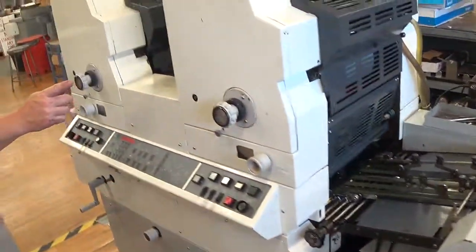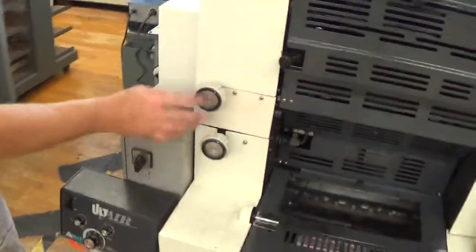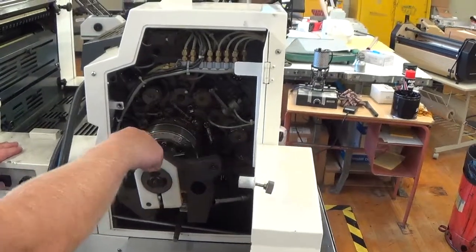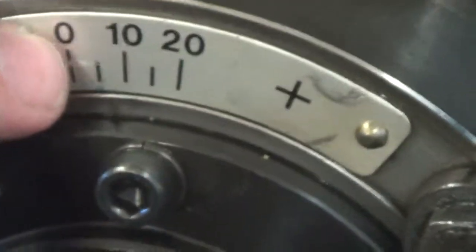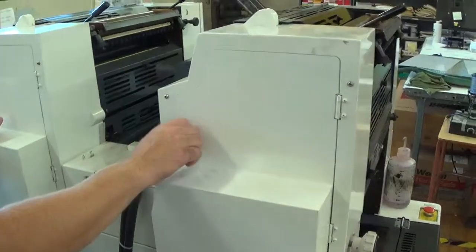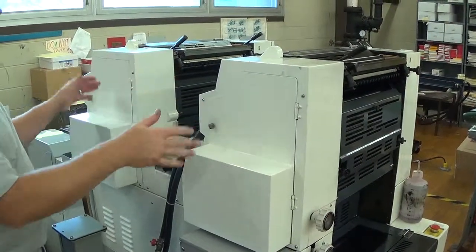One thing I need to mention: remember we talked about these adjustments? These are micro adjustments left to right and front to back. But when we first start out and are really off, we want to use the macro adjustments in here — loosen up three bolts, then use the Allen key. There's a very faint little groove that's my marker, following a gauge from negative 20 to positive 20. You have the same thing on the other side. When lining up two colors, it's not always the same adjustment — it'll be close but not identical. Also, definitely bolt these up because vibration will open it and it'll fall, and you'll think you have an open door.